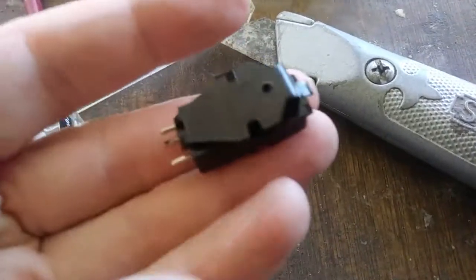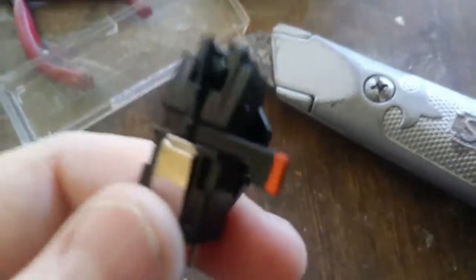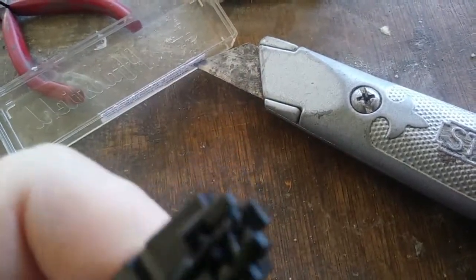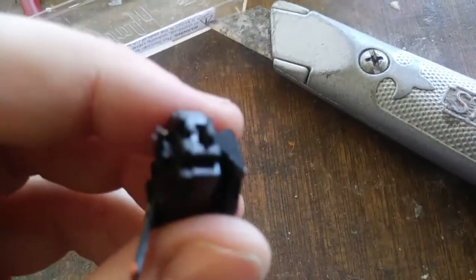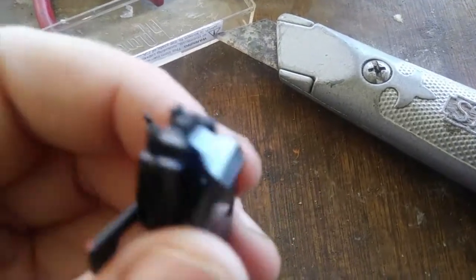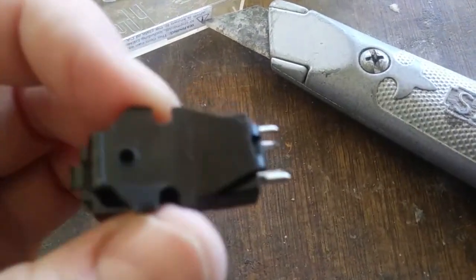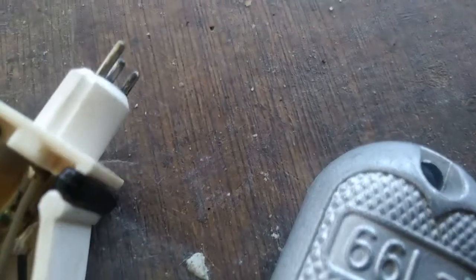The reason I chose this over a magnetic cartridge is it's a lot cheaper, and also if you tend to move a lot, these needles are not likely to get destroyed — they're fairly inexpensive, like six dollars a piece. The same adapter bracket can also be used to mount Crosley-type cartridges, though they recommend the P90192 because they're skinnier. I don't need a skinnier one for this head shell.